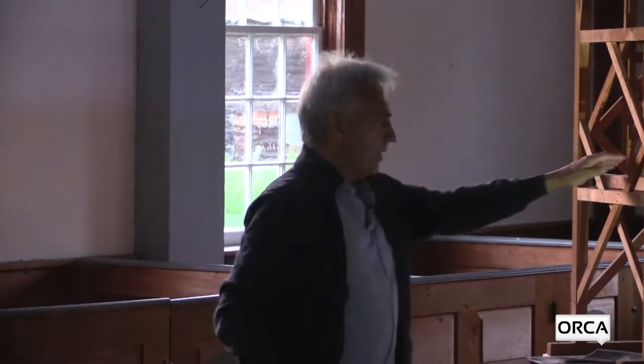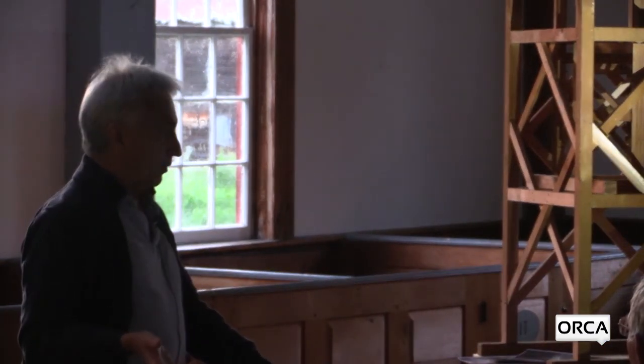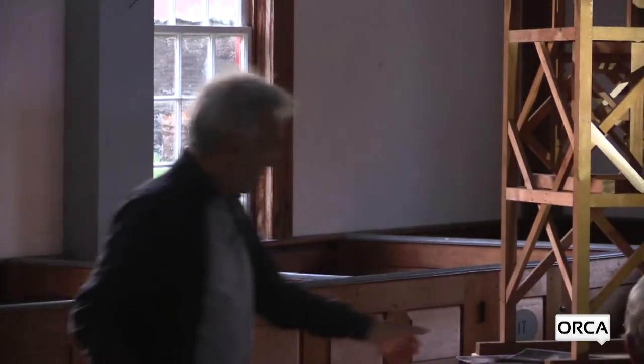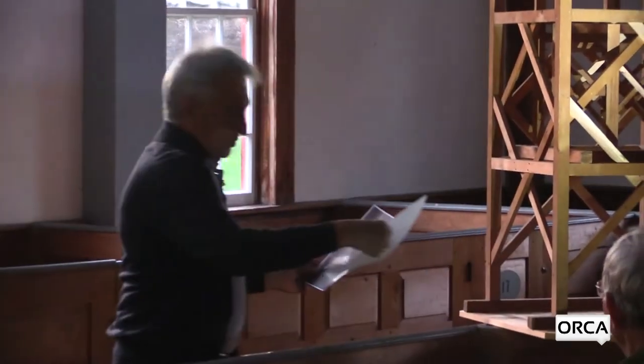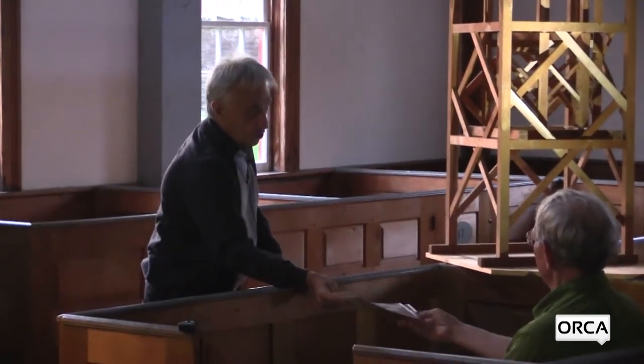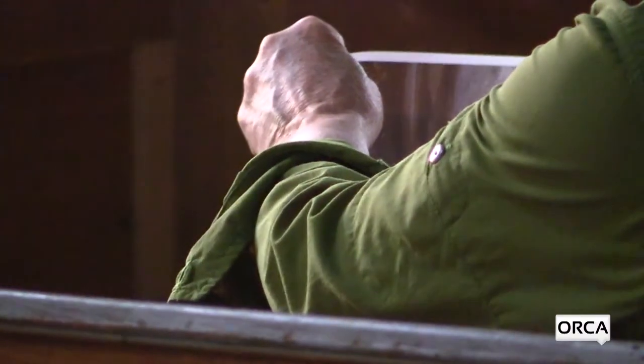Down at the bottom, I'd build up more framing to actually pick up the bottoms of the posts so they're not sitting on little piles of blocks. But it's a rather baffling thing. I don't know if these pictures help much, but these pictures sort of show posts. A lot of them come down and they just barely sit on a plank because of the difficulties of getting bearings supported up in there.